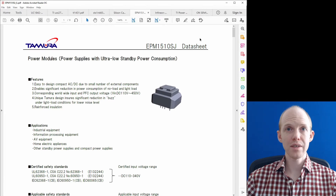For the auxiliary power supply, we'll use a small module as the lazy way to power all the control circuitry. It's about six dollars, accepts 400 V input, and puts out 15 volts. They have versions for 5, 12, 15, and 24 volts.